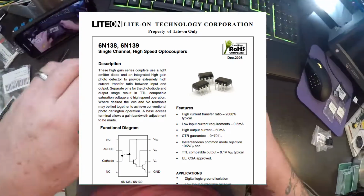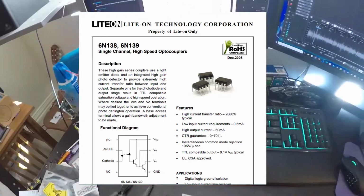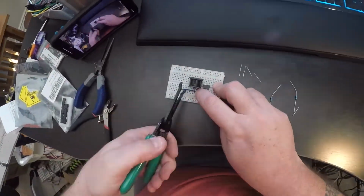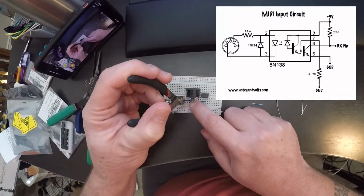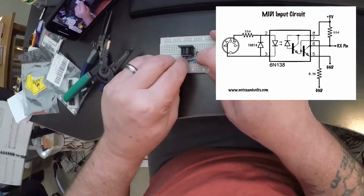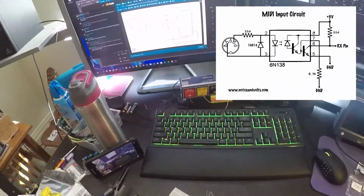If anything goes haywire on the keyboard controller, our synth is safe, and vice versa. So the signal rides in the cable, comes through our connector, goes into the optocoupler, returns back from the optocoupler back to the jack, and this side of the circuit is totally complete and isolated. The rest of what takes place is all on the other side of the optocoupler, in a completely separate circuit.